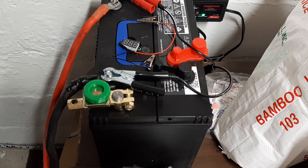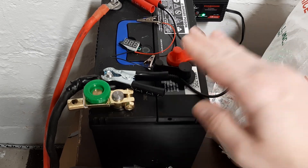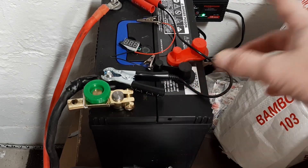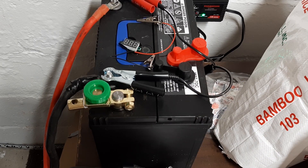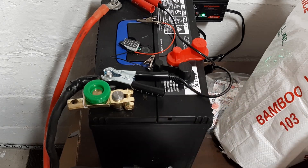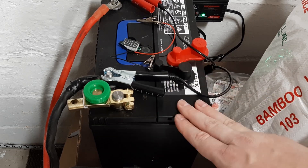The second power goes out, I'm wrapping the freezer in blankets with bungee cords - all kinds of insulation that doesn't block the ports because I don't want it to overheat, but winter jackets, whatever I've got, on the lid to keep the heat out and maintain the temperature difference. I could probably double the efficiency of it. It would almost be easier to just take it outside, start my car, put jumper cables positive-to-positive negative-to-negative in parallel, and charge the battery while revving to about 2000 RPM for a couple minutes.